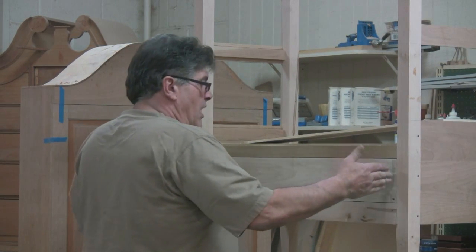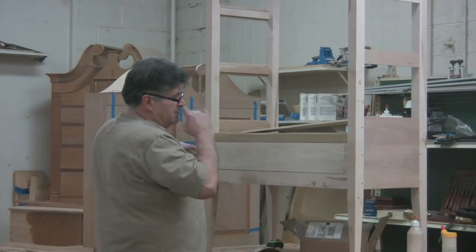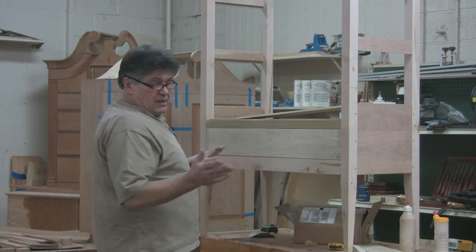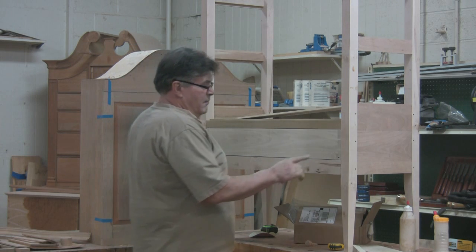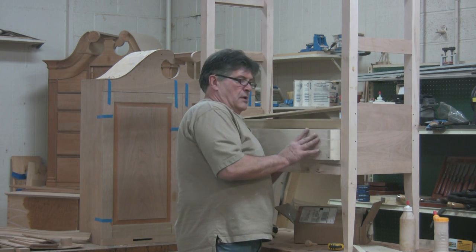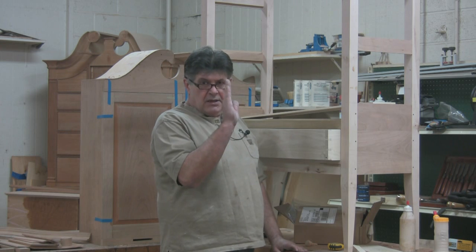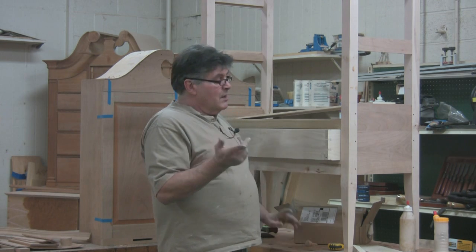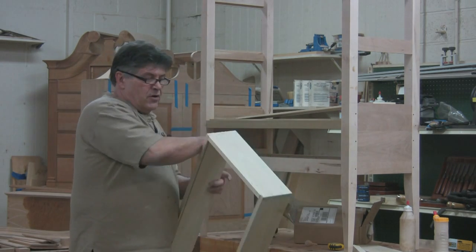So that tells me odds are, what has probably happened is that the drawer frame is not perfectly level, even though I did it with a square. Or my front, which is now the sides in here, when we dovetailed it, could have been just a little out of square. Not supposed to be, but could be. But here's the cool thing. Now I can turn it around.